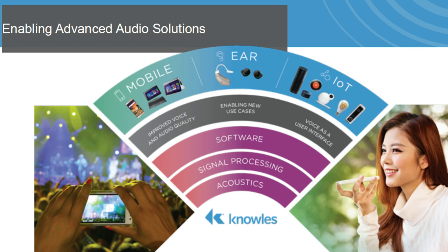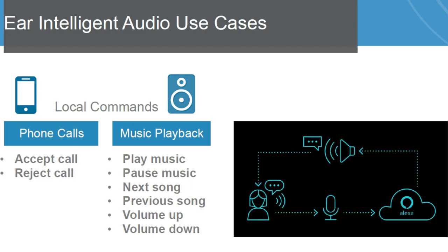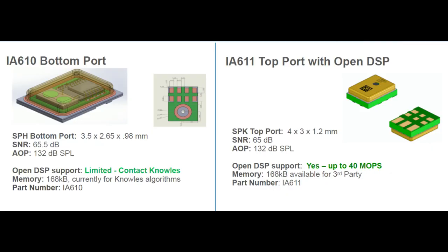Often there are cloud-based backends that do the full command recognition. But to get started, you want a wake word — that's why you say things like 'OK Google,' 'OK Alexa,' or 'OK Siri.' If you can get the wake word detection to happen automatically, you can boot up the rest of the system and do cloud computation for the rest. This chip is designed to be embedded in mobile, headphone, or similar systems, where it can do basic commands or wake word activation.